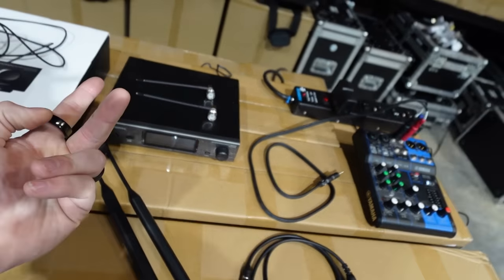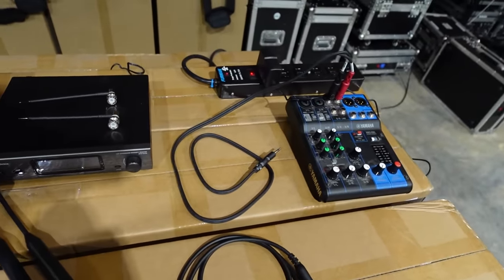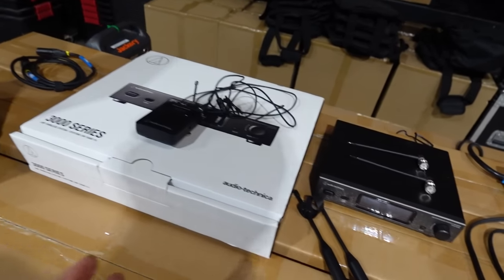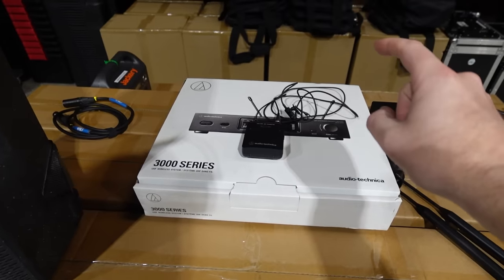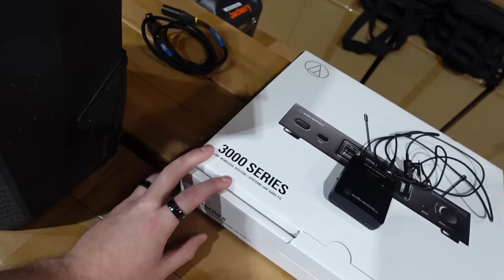What I've landed on — and I've learned this from the pros in the industry — is to just use a wireless microphone in reverse. So if you think about it: this lapel is transmitting audio to the receiver, and the receiver goes to your speakers. All we're going to do is use it in reverse. For this demo, you can use just about any wireless mic that you might have, as long as it has a scanning feature where you can actually scan and get a list of available frequencies. I use all Audio Technica 3000 fourth gens. These are the same as the Shure QLXDs and the Sennheiser G4s — actually the exact same hardware made in China, just rebranded.